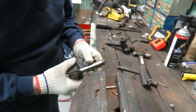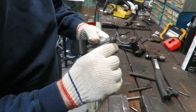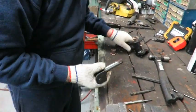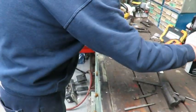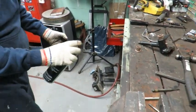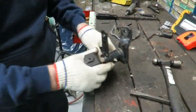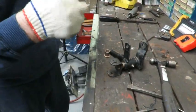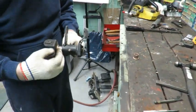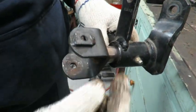This is an old kingpin that I have. You'll see that the top thread is missing — I cut it off and put a nice little chamfer on there, then smoothed it down. Just spray it a little bit and put it in. Now all I'm going to do is pound it in and leave about a quarter inch left on it, and then I'll start the other side.